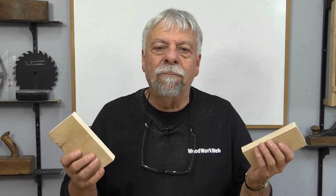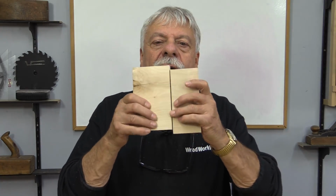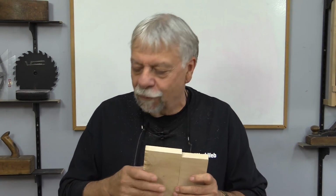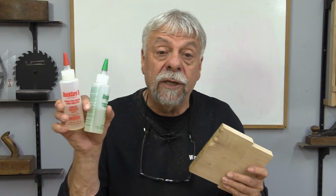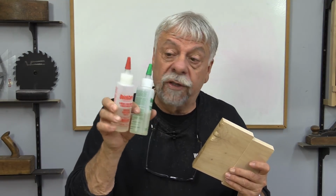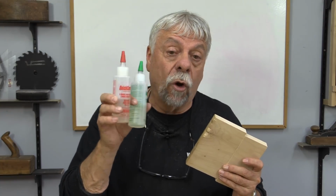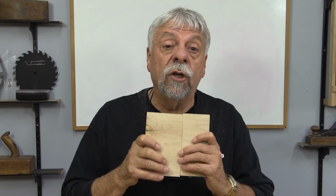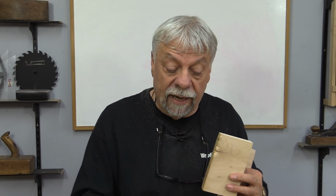If you've been following my channel for a while, you'll know that I've often mentioned that when you try and glue end grain to end grain, it just doesn't work very well. It doesn't matter what you do, it doesn't work that well. But you've seen me use 2-part epoxy, and this is one alternative. You mix the two of these together in equal parts and coat both surfaces, let it sit for 5 minutes, and it gives you a very good bond. But not everybody has that on hand.